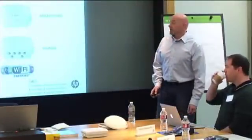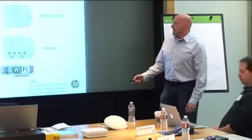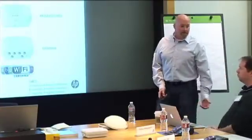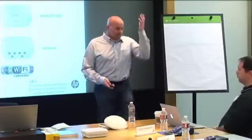We provide PoE. Like I said, we only need PoE. We don't require PoE plus. We support 200 milliwatts EIRP output power, so it's maxed out right across the frequency. We can run it in AP, mesh, or monitor packet capture modes, and they're plenum rated, so you can stick them up in the overhead.